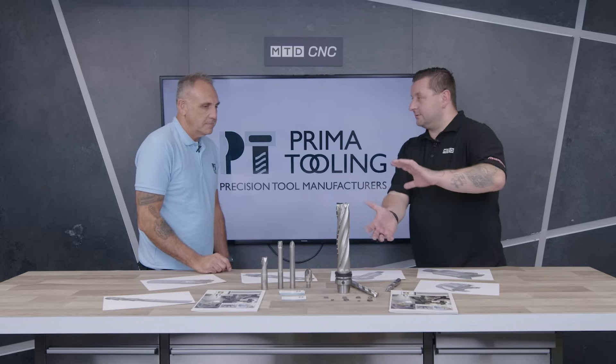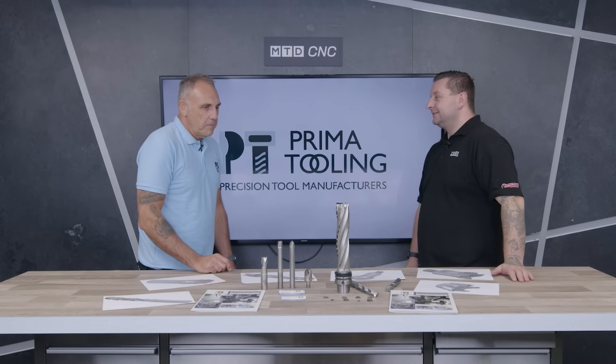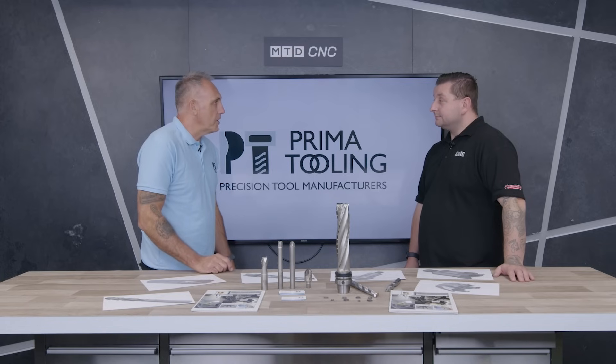I'm dying to get on to the big tool because everybody at home will be seeing this and thinking, what is it? Can you tell us the story behind it? A few months ago we had a customer contact us — they had a tungsten carbide tipped replaceable tip tool that wasn't performing as they wanted. We investigated, and because it was in an ER collet chuck it got sent to us for balancing, which we found was quite out. We advised that we could make a solid tool incorporating the HSK taper as a complete tool and designed it from there.